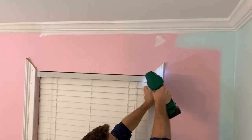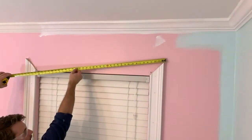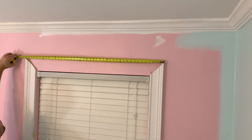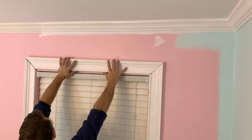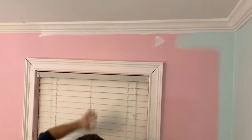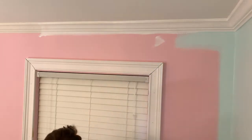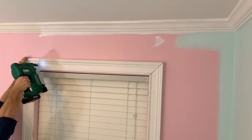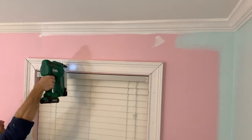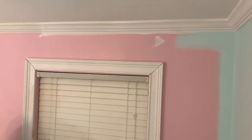Attaching the casing with 18-gauge two-inch brad nails. I'm not going all the way to the right because there's a metal corner piece on that window for the drywall, and sometimes if nails try to go into that metal they bend and get redirected and don't go into the two-by-four behind it. So I'm trying to offset a little bit and put those nails through the center of the casing going into the actual framing. I did the left side first, then came to the right side. You can see how the stool sticks out about a quarter inch beyond the actual casing, giving it the look we're going for. Then I use wood glue between the miter seams and attach the top piece with brads all along the top — four or five of them — and also attach it to the left and right casing with a couple of brads in the sides.